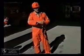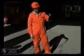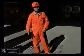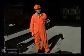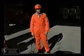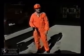A tensionless hitch, we all know what a tensionless hitch is. Just wrapped around the pole, half hitched back and then carabiner back, is 100% knot. There is no loss in the strength of the rope through a tensionless hitch, because you just come straight into your anchor point and it starts to go round. There's none of these sitting there. The knot on the very end onto the carabiner isn't actually taking any load. Because you can utilise a tensionless hitch as a belay system as well, if you've got enough rope, or you can add rope in.